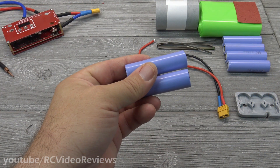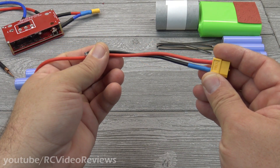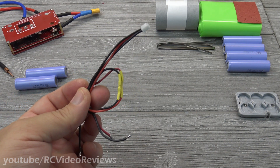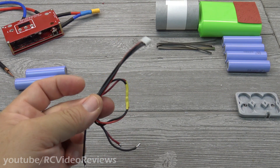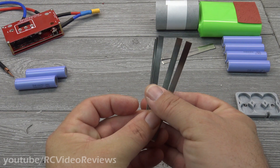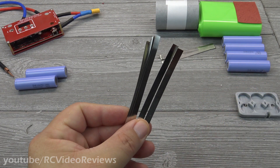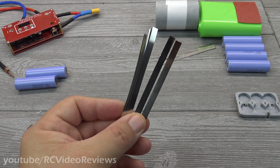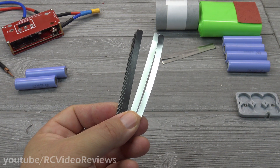Obviously you'll need the batteries to suit your configuration. You'll need some kind of main lead to connect your pack to your airplane. These should always be balanced, so get a balance lead — I have a 3S balance extension already cut to size. For nickel metal strips, you need to do your homework to understand the current you anticipate out of your pack and make sure the strips are thick enough to support your desired current. There are charts available on the internet — just make sure you get the right thickness and width.